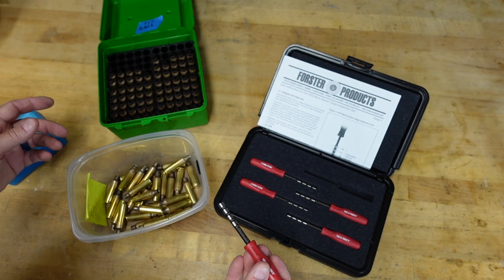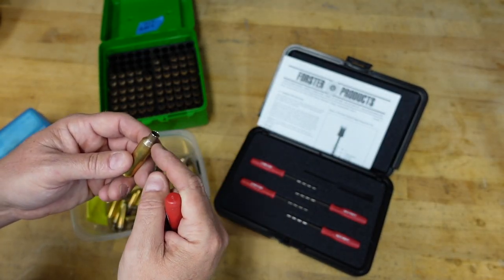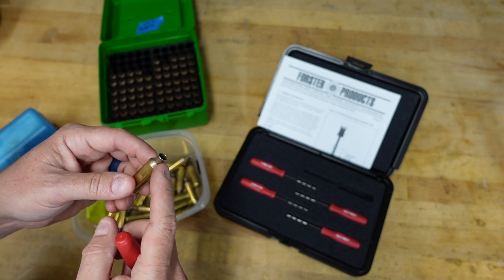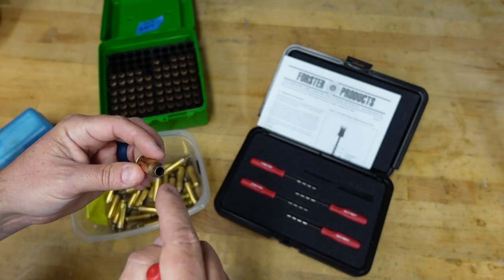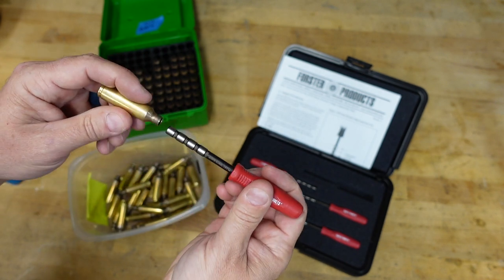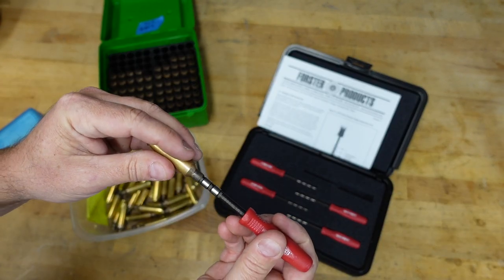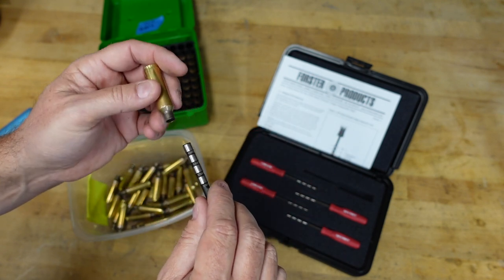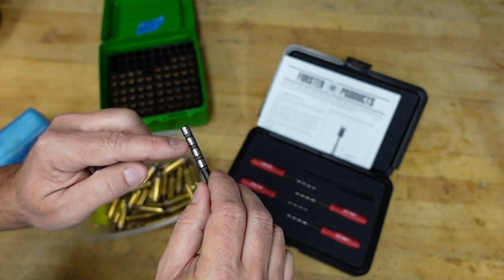The one thing I've noticed is that with individual gauge pins, each one can go in the same amount of space. But I'm shooting a cartridge that is necked up — 6.5 PRC necked up to seven — and cartridges that are necked up end up with a donut inside. I can see my donut in there; I don't care because it doesn't affect my shooting. But when I put this in, the 280 goes through and the 281 goes through, and I'm not sure how much further it would go on the 282 because it's now hitting my donut.